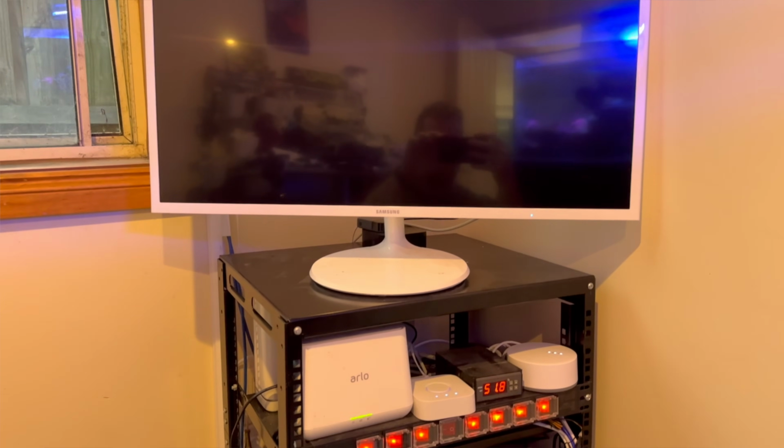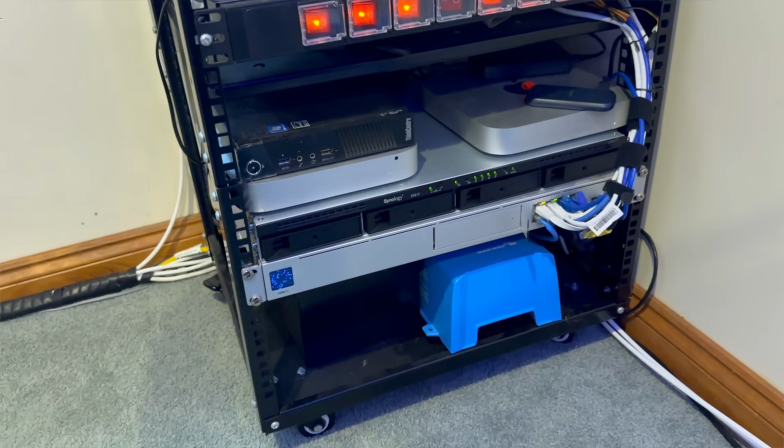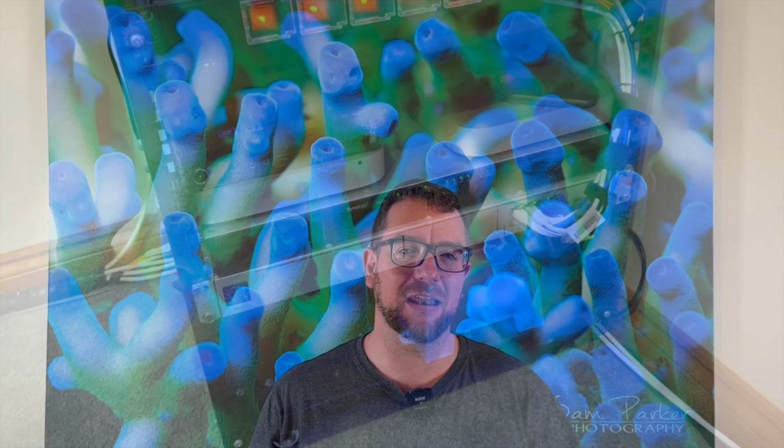If you can set up a quality, either dedicated 2.4 gigahertz network, just for your reef tank, but for any other sort of device in your home that has to connect to 2.4 gigahertz, that is going to give you a huge leg up in this space and save you a whole heap of headaches, because I can say in my home, where I've got an awful lot of Wi-Fi and network connected gadgets, I used to have trouble not just with Kamoer but with other products in general connecting to my network. Once I went to a much more serious network, in fact a commercial spec network, thanks to some of my reefing buddies out there that helped me set that up, I have had zero network connectivity issues, not just with Kamoer but with other brands as well. But back onto topic with the Reef Master SPA, since I've set that up, I have not had one dropout, and it has been 4 weeks now. So got to give that a big thumbs up in my book, but with a caveat of you've got to have a good isolated 2.4 gigahertz network.